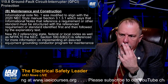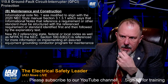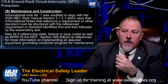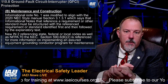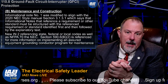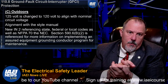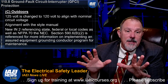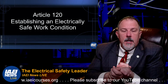Willie, you had made a statement, should be electrically safe work condition. I think the assured grounding program has been a great tool for us in the field. So there is a new informational note that references some state and federal law codes and section 590.6(B)(2) for more information on implementing an assured equipment grounding program. Okay, outdoors, 125 volts is changed to 120 to align with the nominal circuit voltage. I don't believe that it impacts anything. They made some changes in the new informational note. And that's pretty much all in 110.